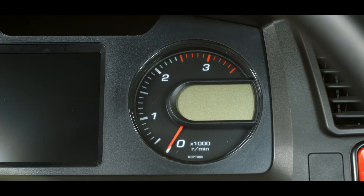The speedometer and tachometer work together in the round part of the machine monitor. The tachometer is a digital gauge with a display range from 0 to 3500 RPM in 100 RPM increments. During certain key-on functions such as manual preheating, this meter unit may reboot with the pointer of the tachometer making one full swing from 0 to 3500 and back again — this is not a failure. The speedometer is displayed in an LCD window with the tachometer gauge and can be programmed to display either kilometers per hour or miles per hour. The range of this gauge is 0 to 99 kilometers per hour. During certain key-on functions the gauge may reboot with the numbers temporarily displaying 88 — this is not a failure.